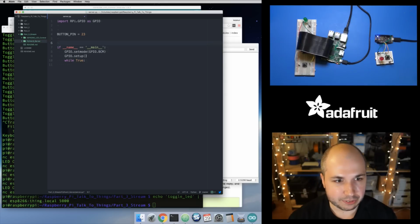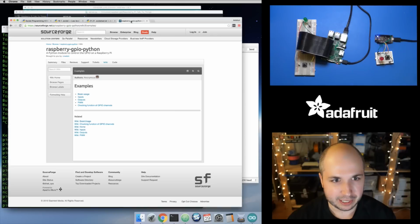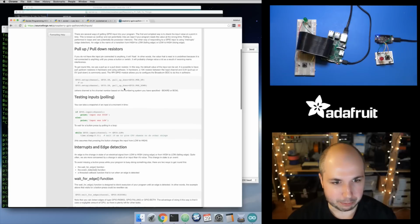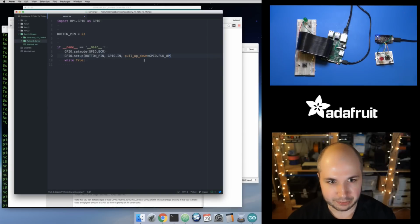So let's set up our button pin, and let's make this an input. And then the little magic thing you need to do with RPi.GPIO to set a pull-up resistor, I'll just go to their examples here. In the inputs page, and I'll put a link in the description below, you want this pull_up_down keyword argument to be specified. This tells it to set a pull-up resistor.